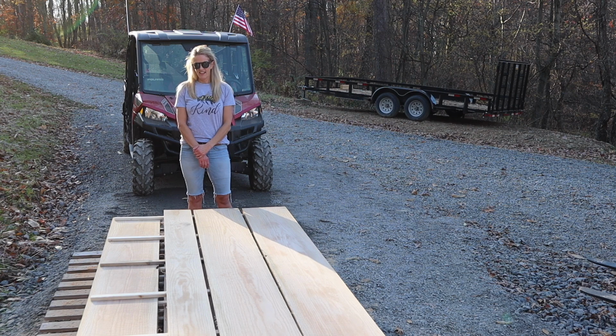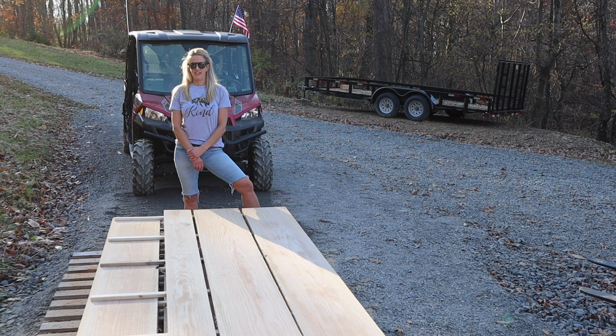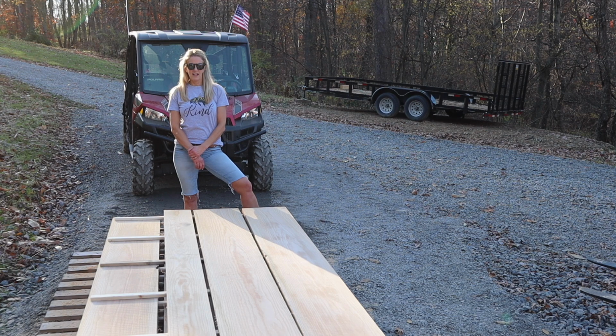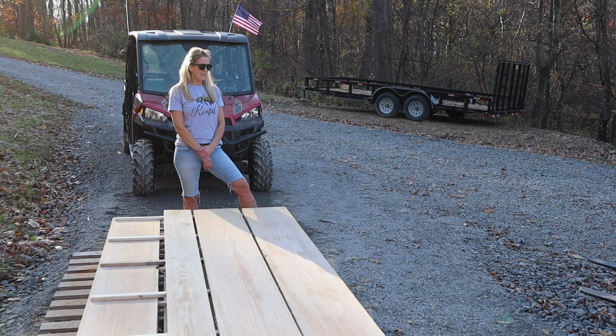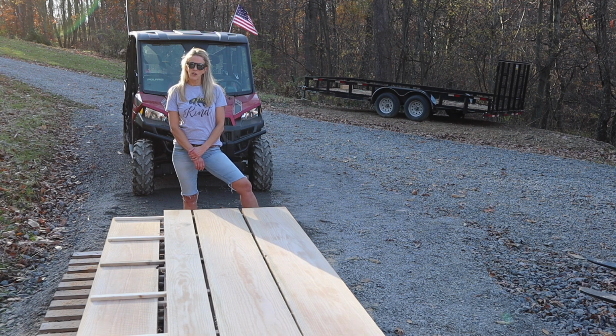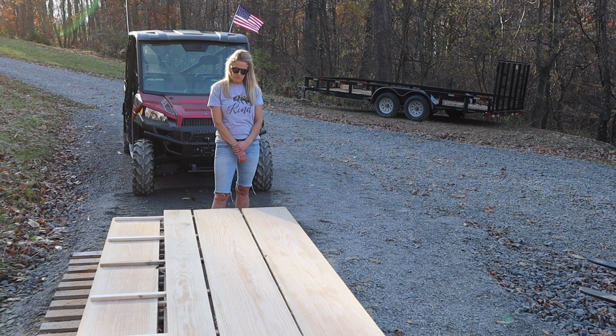What I'll do, I'll keep working on this pile for another week or two when we're sawing, putting 10 footers on it. And we'll get it up about as high as you are, Melissa, maybe even a little bit taller. But about halfway up, I'll put some 4x4s in between so I can lift them off in lifts. I wouldn't be able to lift one 6 feet high like this. That stuff's really, really heavy. But yeah, got a nice flat base.